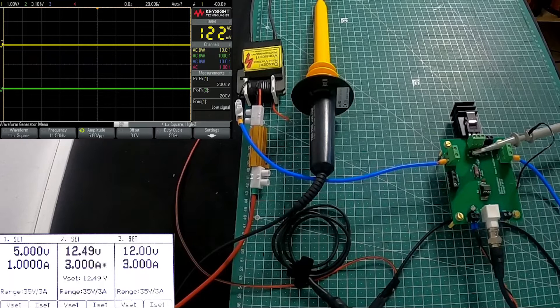For the RC network you need to specifically calculate the values for resistor and capacitance. We are using 12 volt as our benchmark voltage. For this voltage you will have a current draw — that is a value you have to add — and you need to measure the inductance of your coil. In this example it's the primary coil which has an inductance of 84 nanohenry at 10 kilohertz. The resistor needs to be able to dissipate the power which goes between drain and source, because that is where the RC network is connected.